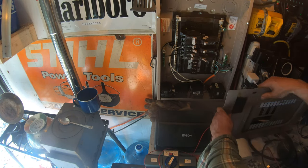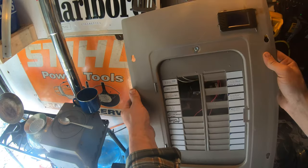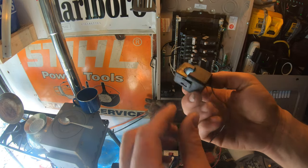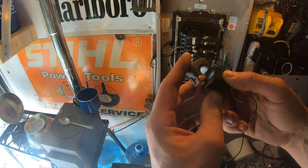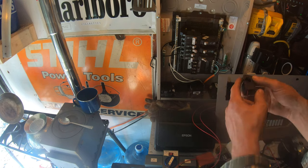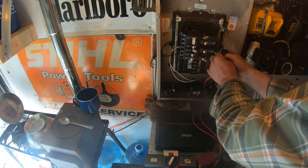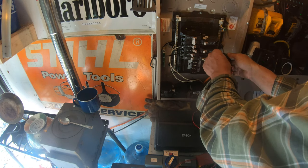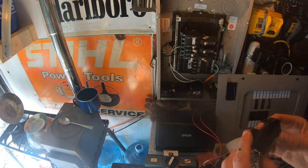Let me see if I can slip it through here with the wires attached. There it is mounted. Here is the little amp clamp - it just hinges like that and we're going to clamp this over top of this hot wire here. I can hear that thing buzzing. I'm going to hook it up first and then snap that over it.